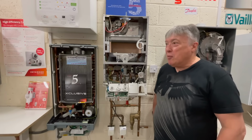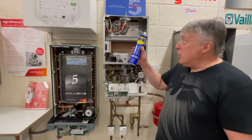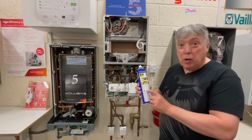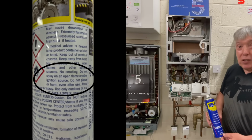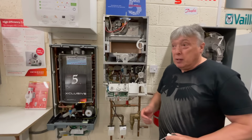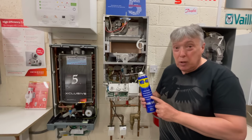One thing we've found out from various organizations is that occasionally, just occasionally, some hero buys a can of WD-40 and sprays it all over here, switches the boiler on, and it explodes. There's a surprise. On the can, it says flammable. It is. It will explode quite happily. And here's a cutaway of the instructions where it tells you, don't put it anywhere near heat. And I've seen engineers look down around, absolutely drown it, switch it on and then whoosh. Some of them, of course, get their eyebrows and their hair burnt off. But basically, they're going to buy a new boiler, which is terrific. So instead of selling a new fan, they're going to give them a brand new boiler. So there's a clever thing. WD-40 is absolutely brilliant. Not for fans.